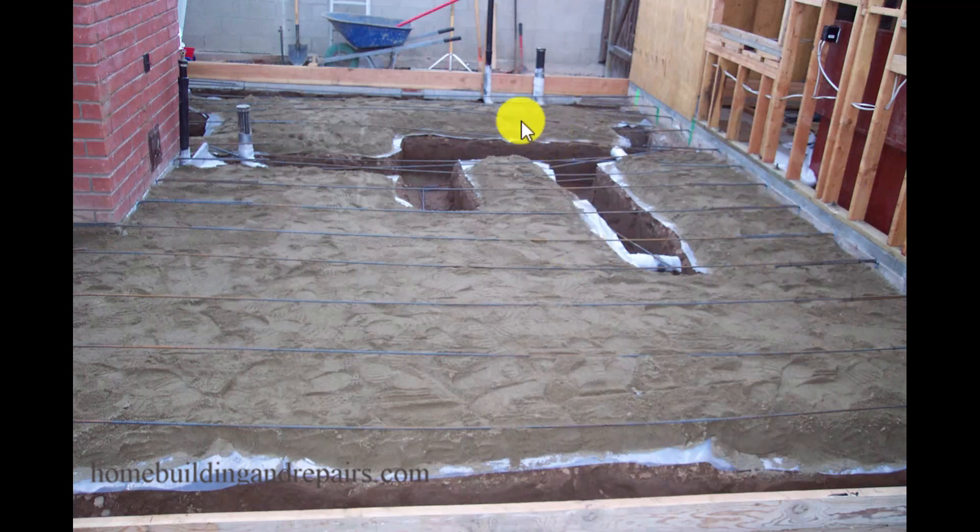This is actually a room addition where we have an existing house over here and a garage over here. We're going to go up over the garage with a two-story and then fill this area in also above with a two-story. So what we have here are two exterior walls, one on each side, and then another load-bearing wall in here. We're going to have a landing over here with a step down in it, and the bottom of the stairs is going to be over here somewhere.